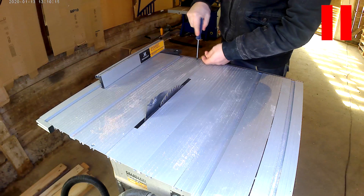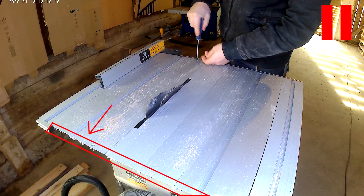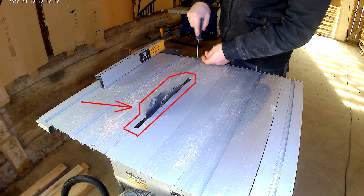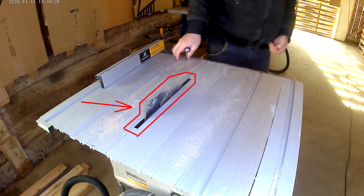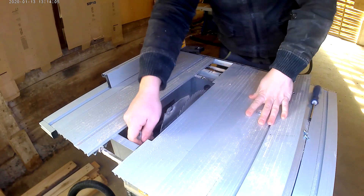Okay let's just talk a little bit about safety now. I had to remove all the protections that prevented me from using the sled. You can see at the end of the saw that one metallic part has been removed, otherwise the sled would come up against it. Then I removed the plastic protection — I'm sorry I didn't film it but it's just a few screws to remove — and finally I removed the splitter.